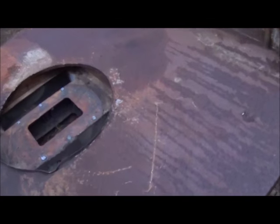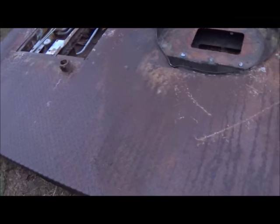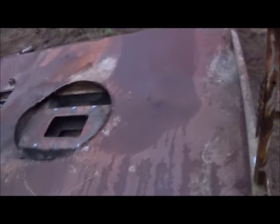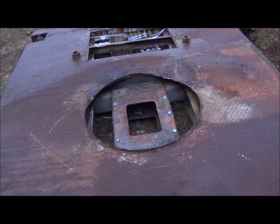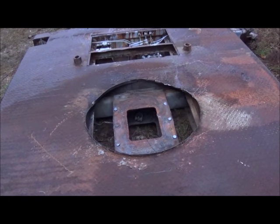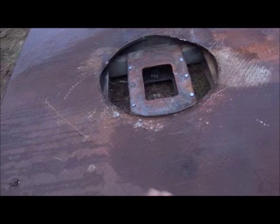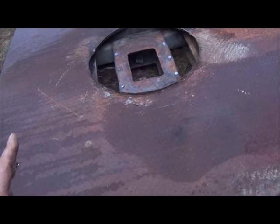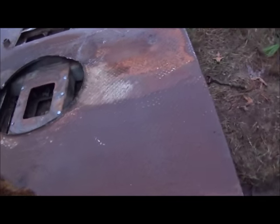The old deck is in pretty good shape, but, you know, a man could mount a slewing gear there and a boom and build his bed off the sides of this and actually keep this deck and everything, but it's not what I want to do. I mean, it would work and it would save me money in the long run, but it's not the look I'm going for. But also, by the time you're able to do all the work you need to do under this bed, the outriggers the way I want to do them, and everything else, especially like rear outriggers, I'd be better off to cut the deck back off of it before I've done it.